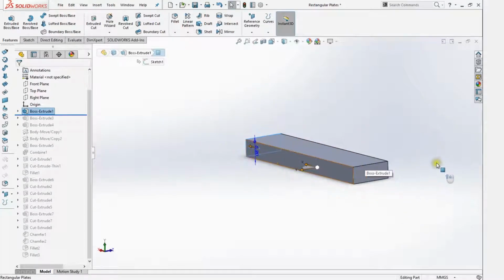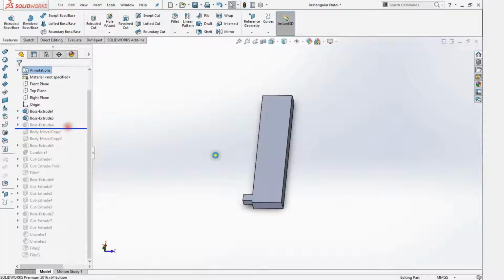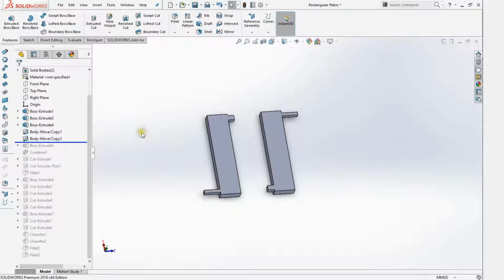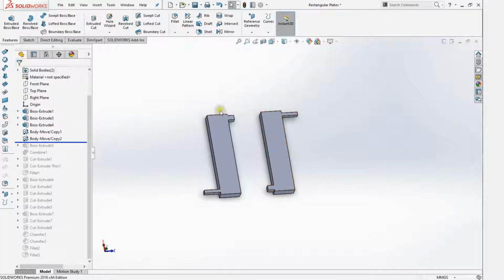But let's just start for now. Okay, so we are adding a gate and a vent. Now I want 2 of these because I know I have a frame that fits this. So what I did was I copied it, and then I moved it, turned it around, because I want the gatings here to go down and meet each other. It's very important that you have equal flow when you have 2 parts. I'll show you how it looks.